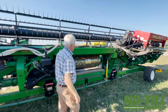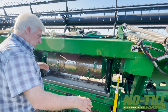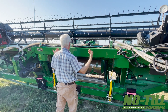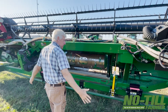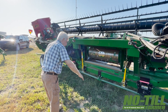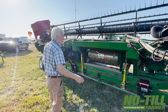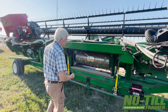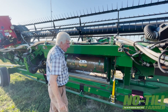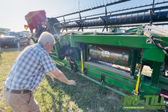Something to consider when doing this: you see there are some extra hoses here. When you're throwing seed off the back, you can't throw it off right at the feeder house because that's the throat of the feeder house. So what we do is get back here on the frame of the combine and put three of them on the axle frame blowing it forward, so that part blows forward under the throat while the rest blow backwards — uniformly getting it on. You do have to attach three hoses to your platform that go back under the feeder house.